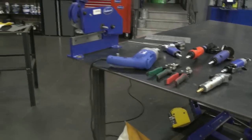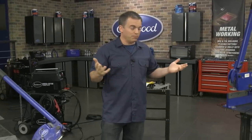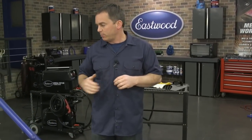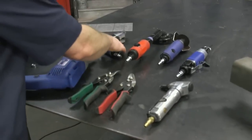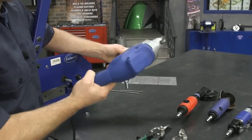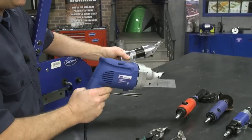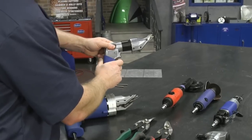We're going over a bunch of tools you're going to need in a restoration or any kind of metal fab — including some you might not have known existed. We'll show examples and cut some metal with a lot of these tools, including the plasma cutter. First, let's look at what we've got: two forms of shears — pneumatic shears and electric shears. I prefer the electric shears; these will cut up to 18 gauge. Right here we have the pneumatic shears.